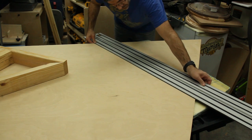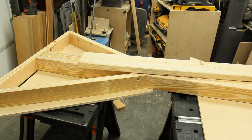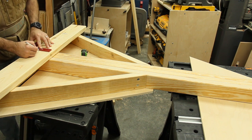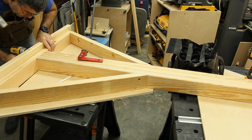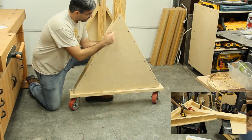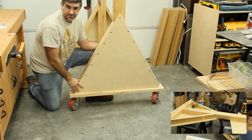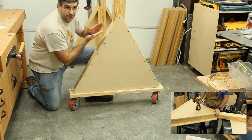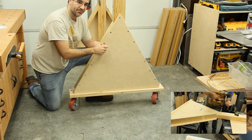This way the actual 2x4s don't have all the support just on the screws at the top and the bottom — it's got a connection essentially all the way up the leg. Here I'm adding that 2x6. I sat one half-inch piece of plywood underneath to get just a little lip on that one side, having it stick out a little further on the outside. Using really long PowerHead screws mounting this on, it's going to be solid as a rock — I have no worry about this coming apart. By having these screwed on all the way down, it's even more rigid; the weight is distributed across the entire 2x4 and not just the top and the bottom, so there's no capability of the 2x4s bowing.